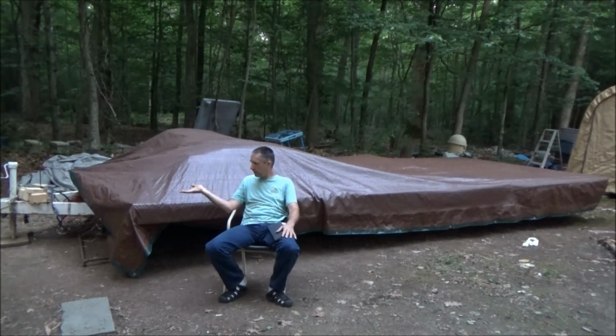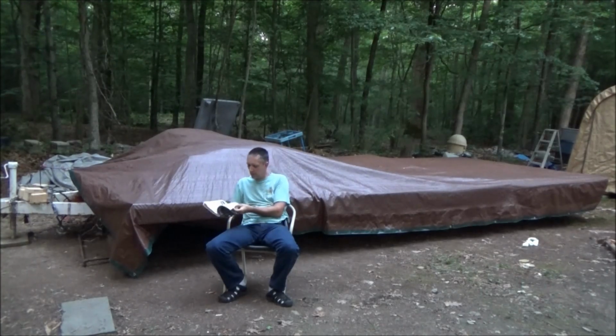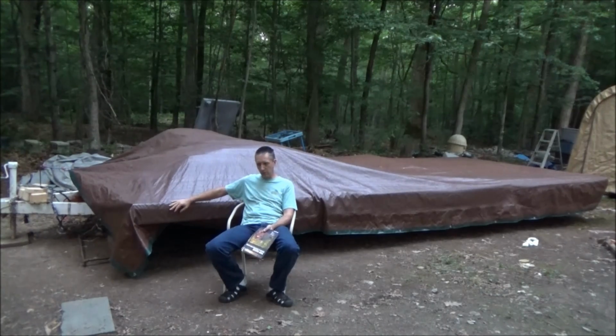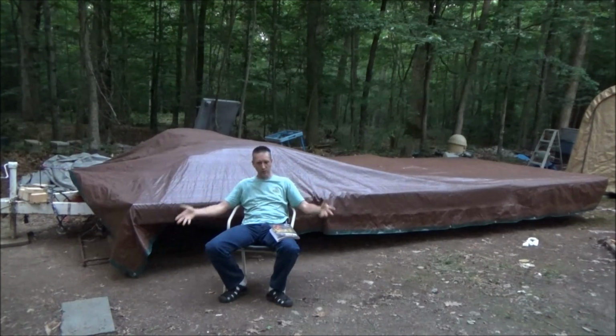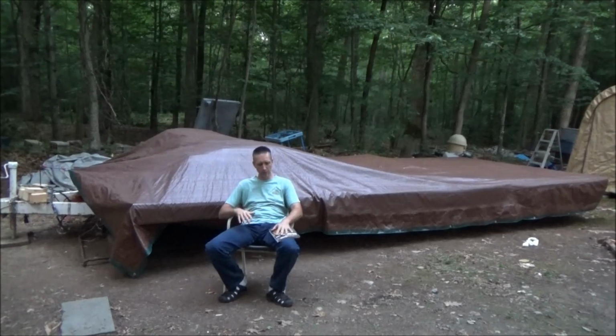You've got an aluminum bottom, your wooden framing, insulation, and your subfloor. No vapor barrier, no holes for breathing. Tiny home design, and I've looked at this thoroughly today. I studied and analyzed the photos of the flooring. Even when they use a flatbed, and because it was really making me think about flatbed trailers, I thought maybe that's different. No, these guys recommend taking your flatbed and removing every second board on the flatbed trailer, exposing the bottom of your home. Then they lay down flashing, then the framing of the floor, then insulation, then their subfloor. No vapor barrier.